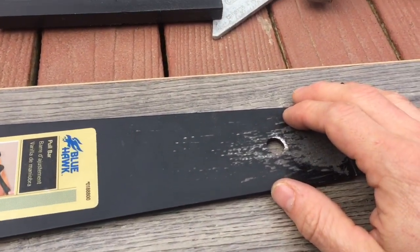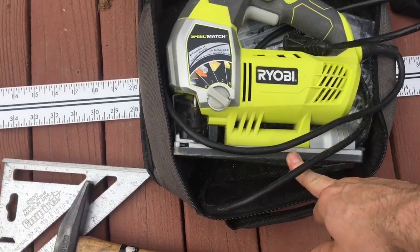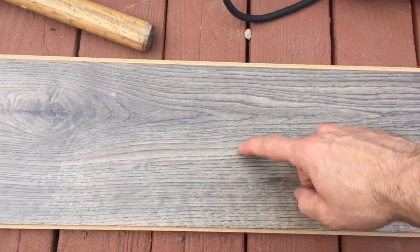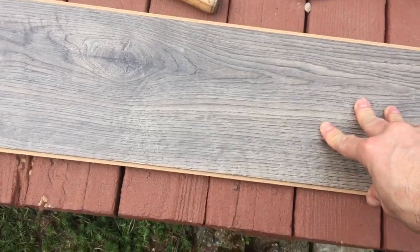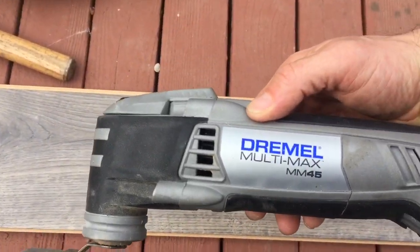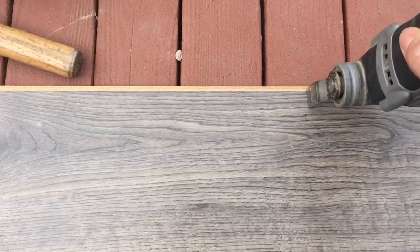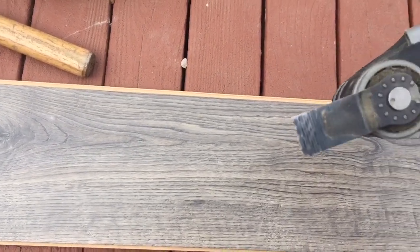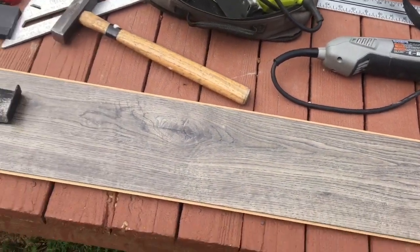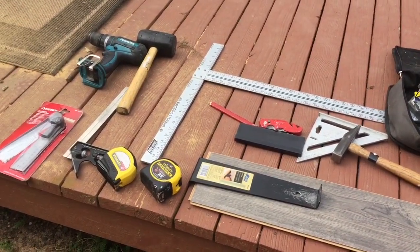Next you'd use your jigsaw. You can use a table saw or chop saw, but I use the jigsaw because a lot of my cuts go in and out — the jigsaw is good for all of them: straight across, in and out. Then this tool here is called a Dremel Multi-Max. It's great for notching things out — I just use wood or drywall blades and they last a fair amount of time. You can notch things out pretty simply without having to re-cut everything or do a bunch of additional work. Those are the tools I used — they helped me get the job done quickly.